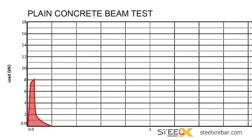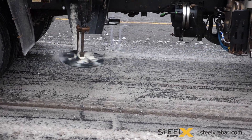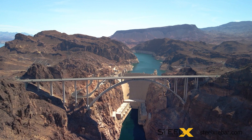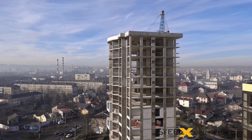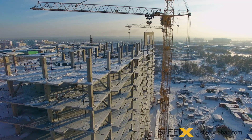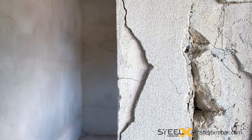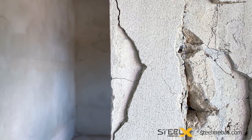Concrete must endeavor to withstand whatever work it was placed to do. Unfortunately, it was born to only be punished. The jobs given to concrete are so numerous: pavements, walls, bridges, floors. While concrete is doing its job as a driving surface, holding back soil, or sustaining the load of a skyscraper, it also has to withstand the environment — expanding and contracting during daily temperature swings without tearing itself apart. It has to withstand impacts and chemical attacks. Concrete's ability to do all these things and remain in good shape is durability. The ability to resist cracking under a load is likely the most significant factor of all.